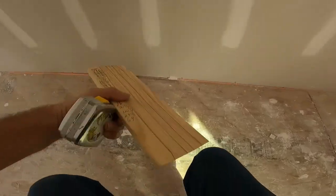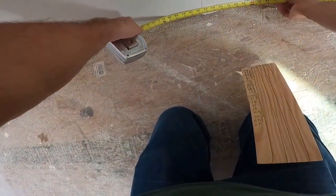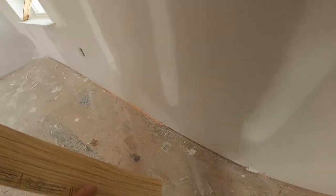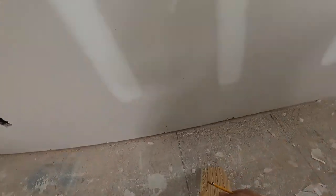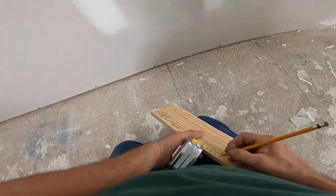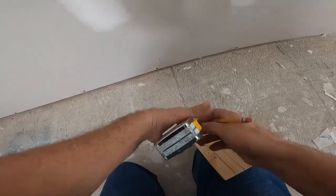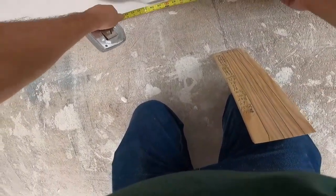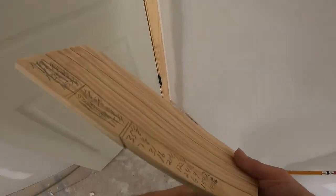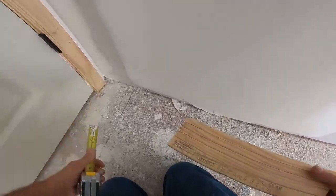Okay, here's my first 100-inch mark. Here's the mark that I made, just like the crown molding, full measurement. It's 54 7/16, so plus 100, 154 7/16. On here, it's 43 13/16, so plus 100, 143 13/16. We'll check on that, measure twice, cut once. Yep, 143 13/16. And you have one hiding behind the door here. About 13/16.